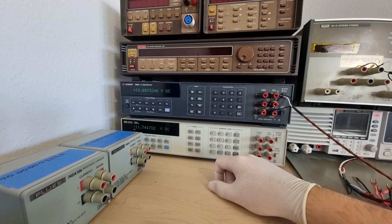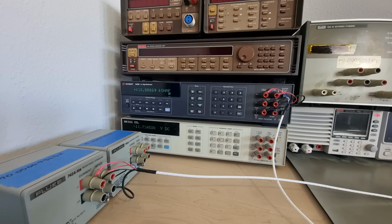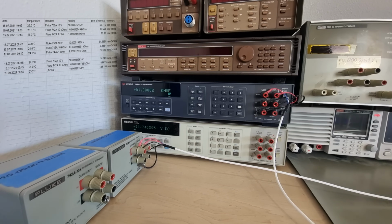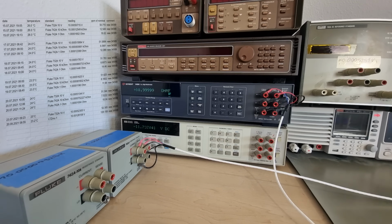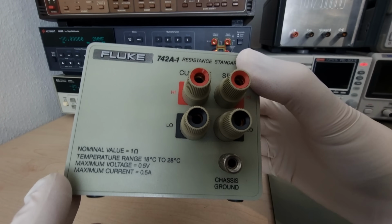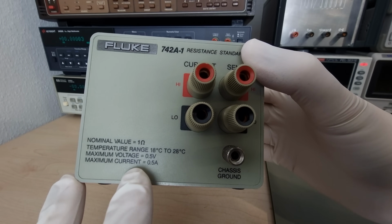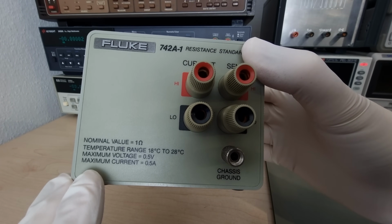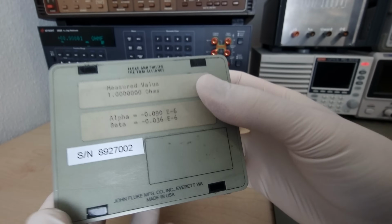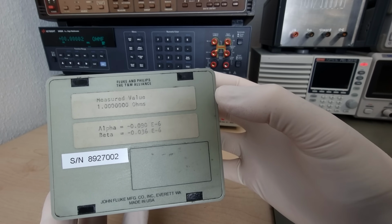With the simple one-dimensional standards like 10 volt, 10 kilo ohm and 1 ohm, that really just means to take some measurements and to write them down somewhere. I've done that occasionally over the past few months to make sure that none of the participants drift excessively. Especially this 1 ohm standard, which I bought untested off of a private eBay seller, had me worried. It is so easy and inviting to abuse it as a high current shunt. But no, to my great relief, everybody has been rock solid since July.